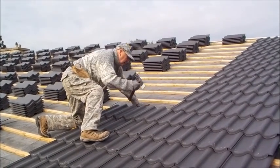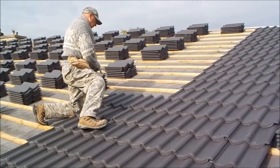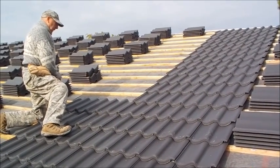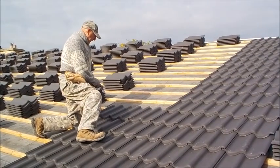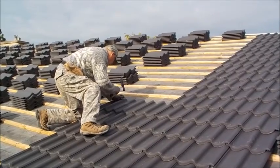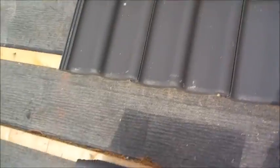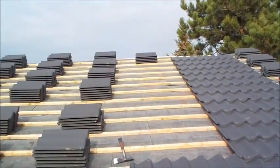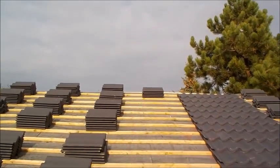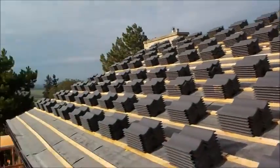Again, not quite on the line. So just enough for me. I'll get these nails in and I'll take the camera off Alice, who's filming me, and I'll show you how straight they are. If you look up there, that line is absolutely straight, and this one will be the same. And here's the line, look, you can see the red line. If you stick to that red line, you can't go wrong. I've marked it out. I should have just over a quarter of an inch overhang that end. Look out the same at the other end, which is down there.